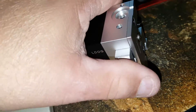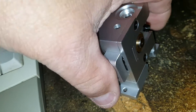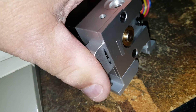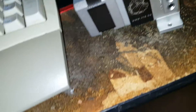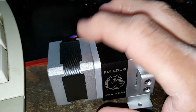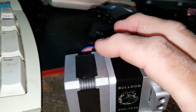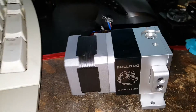It'll do 3mm, it'll do 1.75mm, and it has adjustable tension via these two screws. I'm going to back those out and take some of that force off, because that's excessive — I wouldn't imagine ever needing that much force, not with a gear-driven system. I think it's a 5.1 gear ratio, so basically you're going to run this without heating up your motor. On most direct drive systems, if you do large prints, your motor gets hot — you've got to put a heat sink or a fan on it. A direct drive on one of these motors for 3mm filament is not going to happen without a lot of cooling. So this is the way to go.